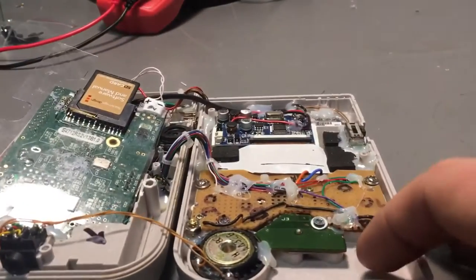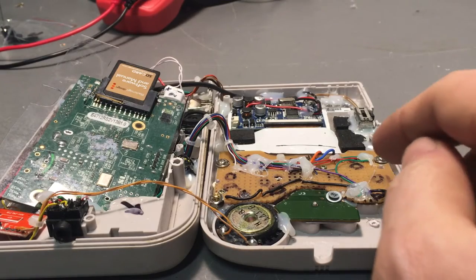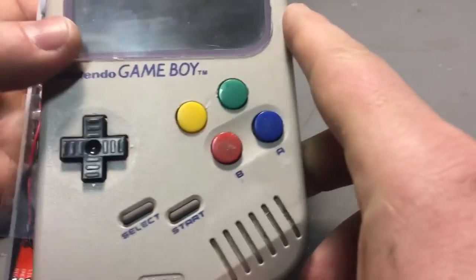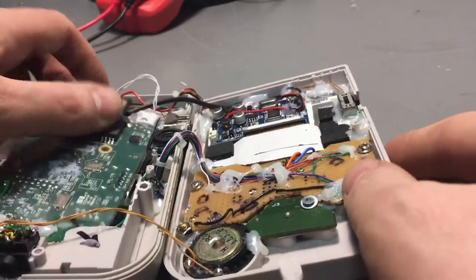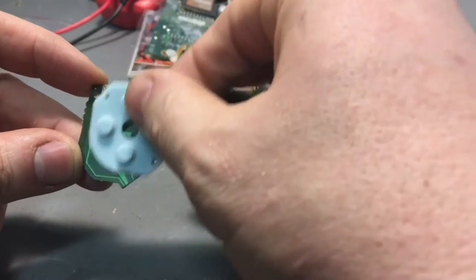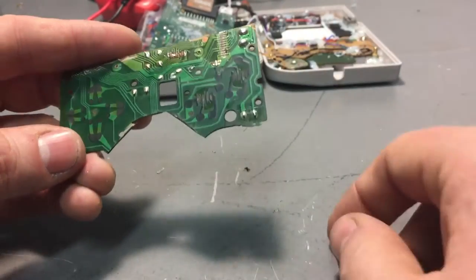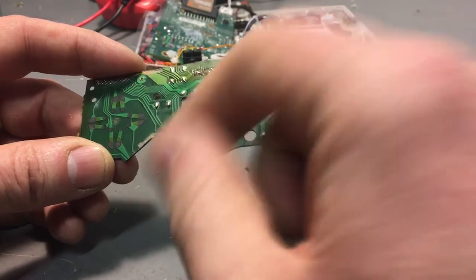Here's one I've been working on for a little while — my first build. I wanted to talk a bit about how I achieved some things. The keyboard on mine has A, B, X, and Y keys, as well as the usual start, select, and the D-pad. I've also got shoulder left and right on the back using little tactile switches. But to achieve that, you've got to go a bit beyond what the original Game Boy had. Here's the other side of the PCB where the resistive pad sits — it shorts out the carbon tracks and you get button presses. But this is just for an original Game Boy: I've got A and B, but no X and Y. The select and start buttons are particularly fiddly, so there are a couple of solutions.